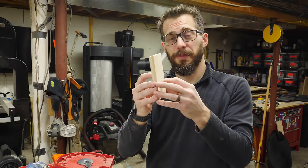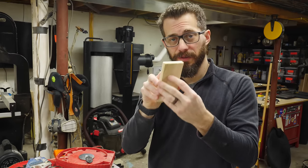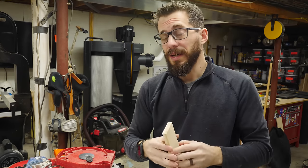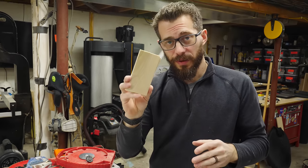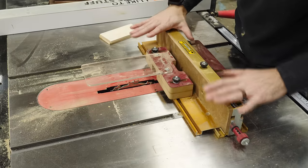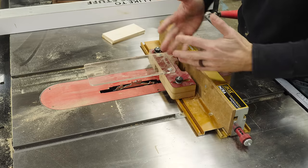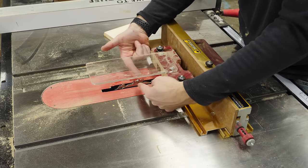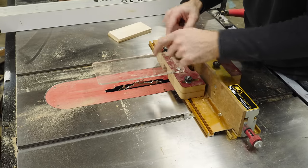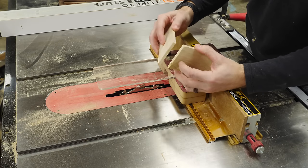The material I'm using is pretty thin, so making a box with just butt joints probably wouldn't be very strong. Instead, I'm going to connect these with finger joints. That cuts a groove in the end of each piece so that they fit together like your fingers. You can make a simple jig and use a regular saw blade, but I have a nice jig that uses a dado stack. The cool thing about this one is that it's variable, so you can use it for all different sizes of fingers with different size material. I've got it set up with a quarter inch dado blade, and it's really important to do a lot of test cuts to make sure you get a nice tight fit.